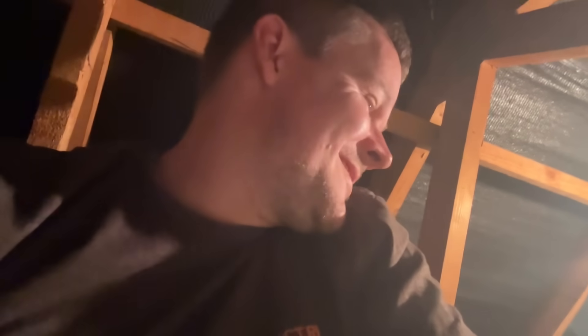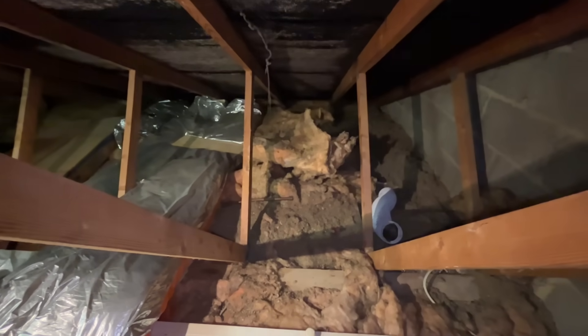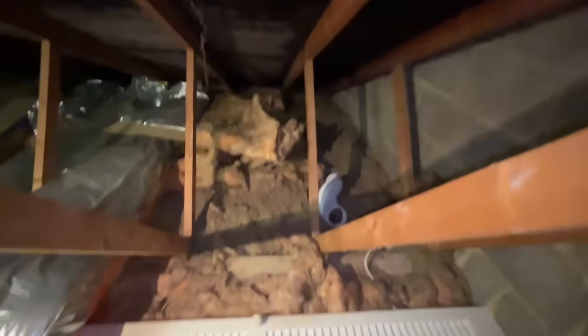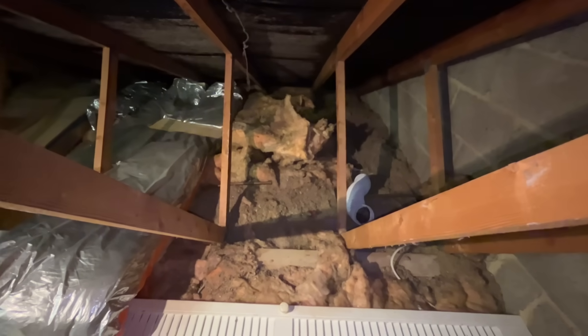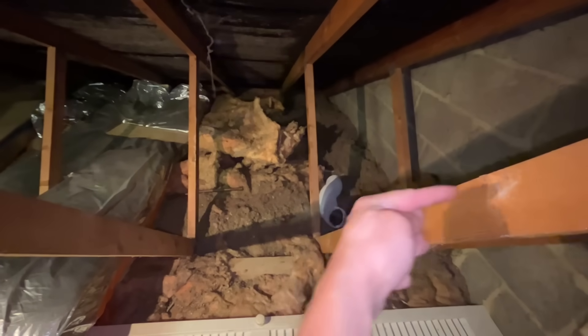I just rang the builder. James is just mulling around. If I drill these holes we're going to get covered in that crap. It wants someone to come up here and hoover it out. Right, I've moved all that crap now. So this is what we've got to work with on a Friday. We'll mark out where we're going to drill, move this crap, put a Wago box up here, mount the fan. What's that side of the wall? Is this terraced? There's an alleyway. So we'll get the builder to drill a hole out — we ain't doing it. We'll leave the fan up here with enough ducting to go out that way, straight out the wall.